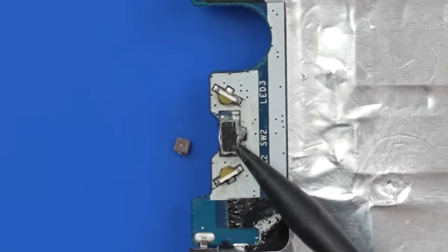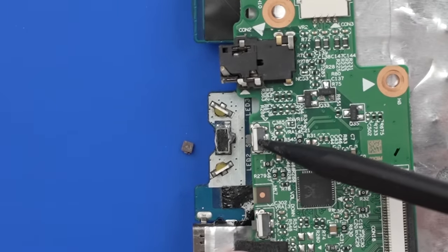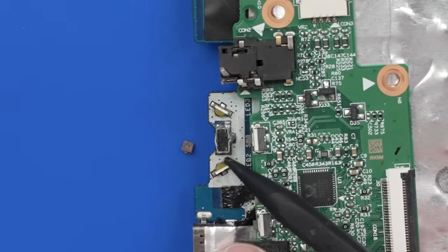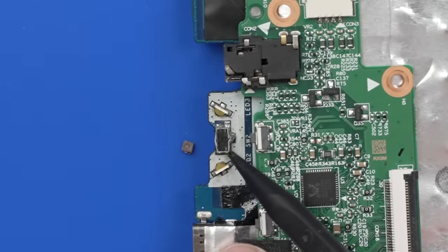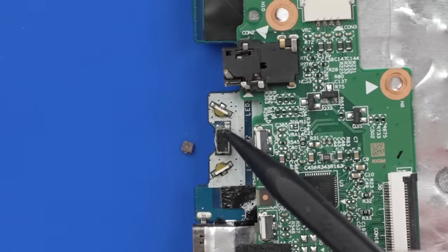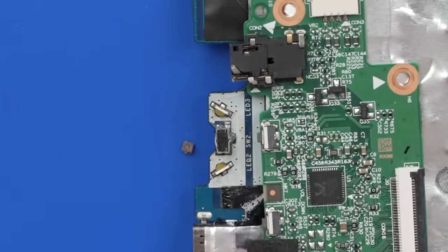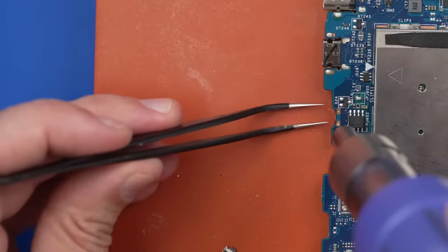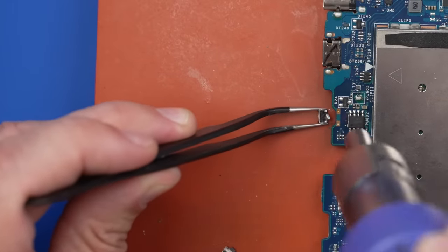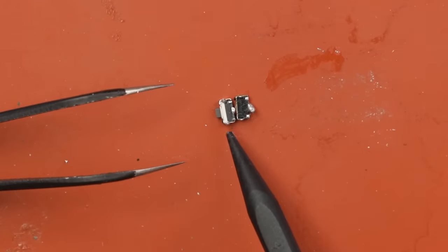So now I have to see if I can find a replacement button. I found this little board on a junk laptop I have laying around, and it's got a button here which is pretty close in size. This button has one pin here and one pin here, while this button has two — but I can't tell whether that's just for mounting. I'm going to remove both buttons and then inspect the board to see what kind of mounting options we have. As I match these up, these buttons look exactly the same, so I'm going to try installing this one.